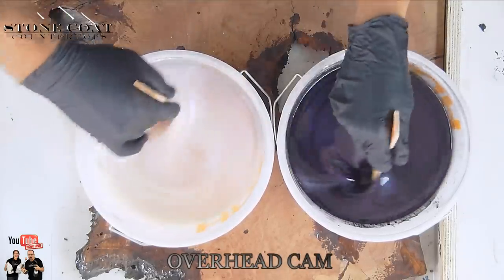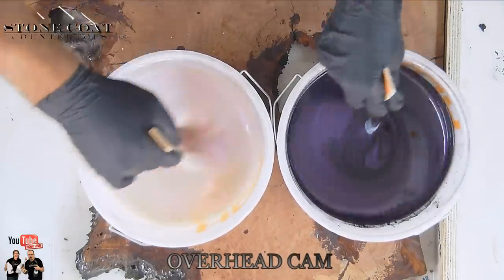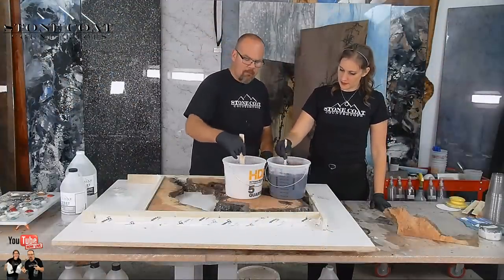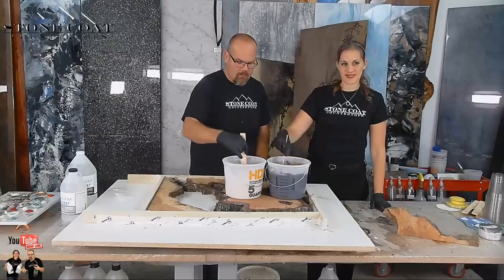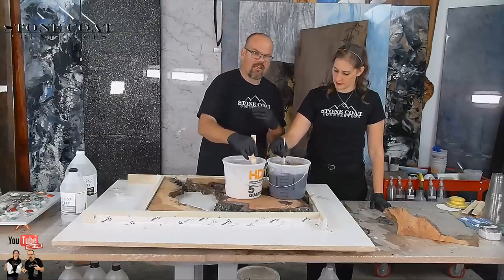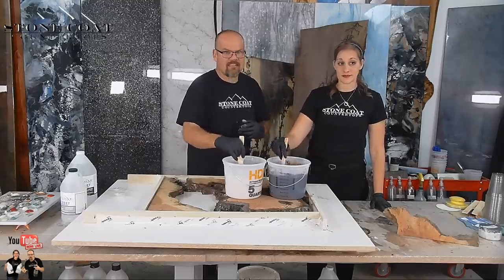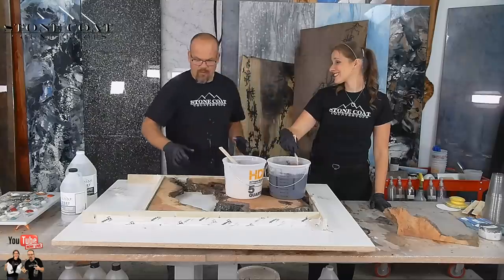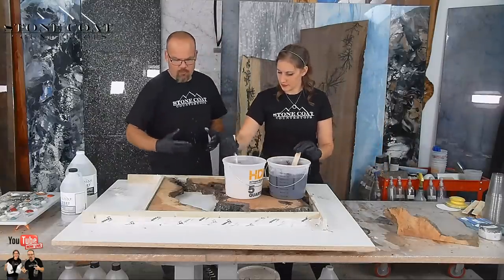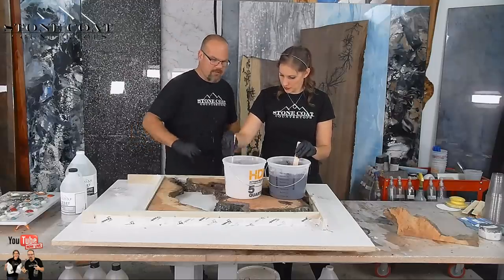What's the setup time on this new product? Oh, very good question. That's what I was going to ask. It's still about the same setup as our normal Stone Coat countertop epoxy. You're going to want to wait 12 hours before your next step on it, but you get to pour a lot thicker. We're going to do the final release on how far we think you can pour, but mass is important. When you've got lots and lots of kits that you're mixing up, and you're going to do a table that you want to remain crystal clear, that volume is going to affect your actual project. So we're getting all that dialed in so that you have exact information and you know what to expect.